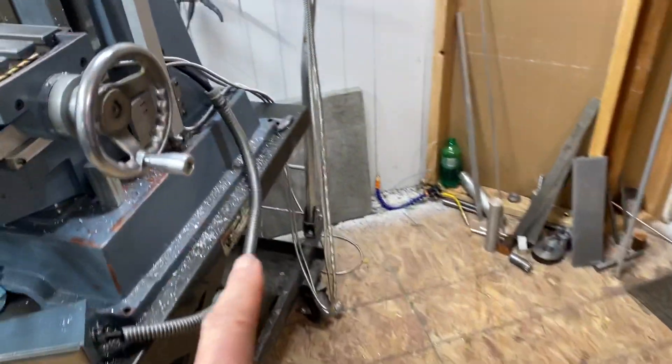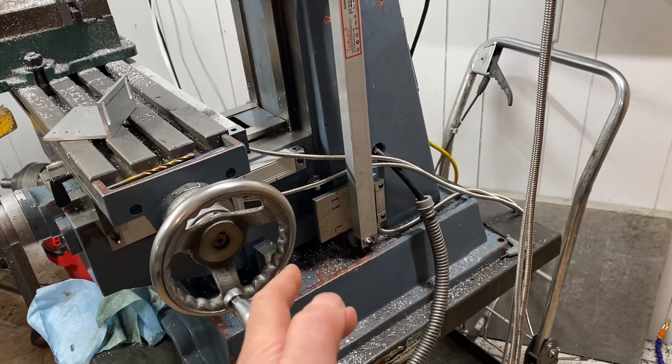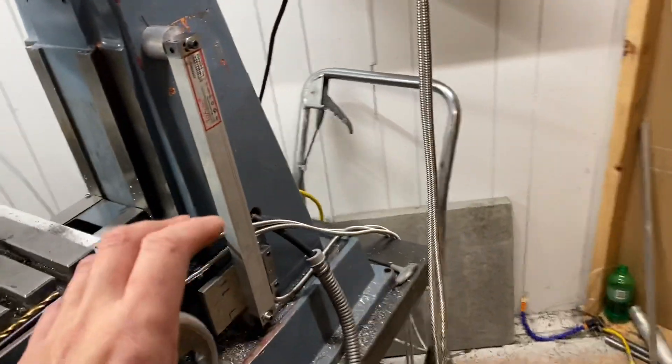Initially I made this lower mount with the angle at five degrees and it just wasn't quite right, so I ended up having to change it. That actually whittled more aluminum off of it, which brought it a little closer to the column - which it needed anyway. So after finally figuring out what the angle was...